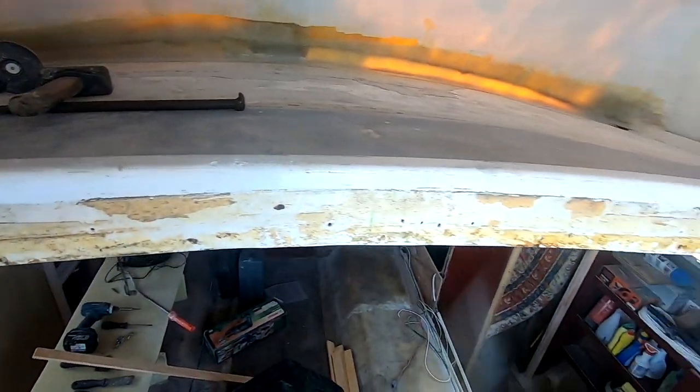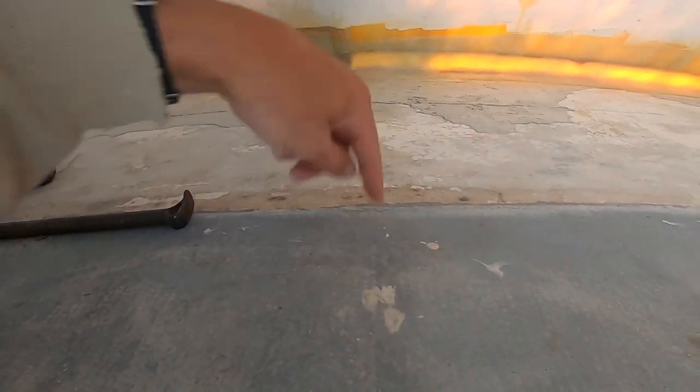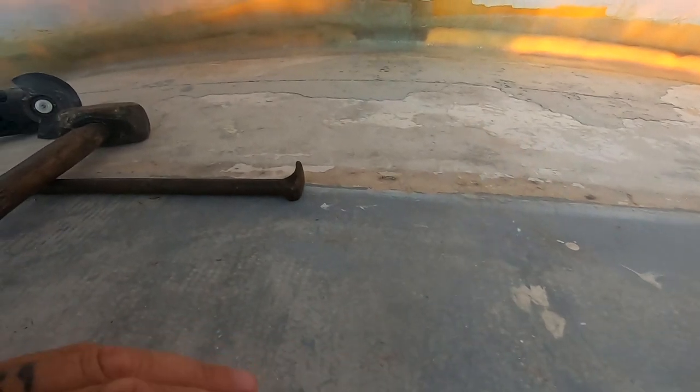So what I may have to do is cut it in half. Cut through there, take it out in two panels, so it's a manageable size and weight. So what I'm going to do now, rather than chatting, is with the blade that I've got left, come to about halfway, cut a line through down, do the tram lines down here, and the tram line returns there, so I can get the core out on that strip, which then allows me to cut underneath and drop that panel out.